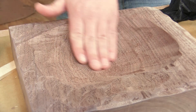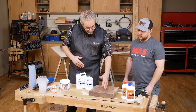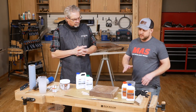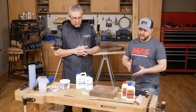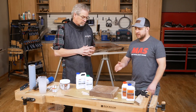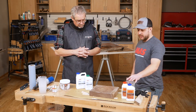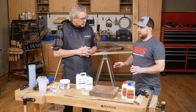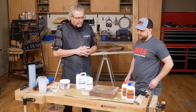You mentioned that this would have been a good place to use the penetrating epoxy — why is that? It's kind of a safety concern for your piece. Wood is not cheap, and if you were to skip that step, you could potentially get bubbles and foam. It is fixable — you're just going to have to sand it down a little bit and do another pour. The penetrating epoxy is basically the first step to eliminating risks of air, moisture, and foam coming out while the epoxy is curing.